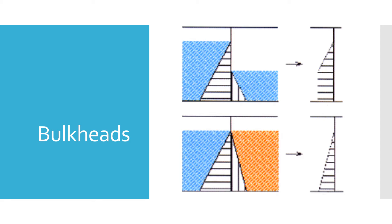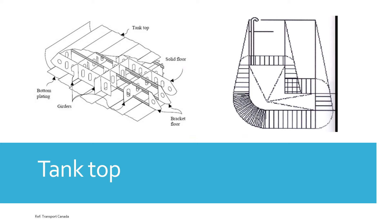At sea, because of the ship's movement, the resulting sloshing effect of liquids multiplies these forces and increases their strength. For strength calculations of this kind of bulkhead, it is assumed that one side is empty while the other side is filled with liquid to the height of the overflow pipe on deck. When a bulkhead also has to function as support for heavy deck constructions, there are additional compression forces. Bulkheads fitted against torsion of the hull must also be stiffened with diagonal forces in mind.